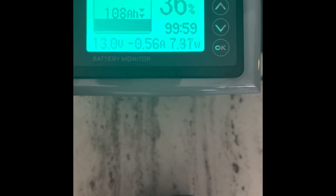This is a Renogy battery monitor, recommended by William Prowse. If you want to know anything about solar, lithium, or these types of setups, William Prowse is the guru. Right now I'm showing 13.0 volts and a 0.554 amp draw on the batteries — I have some motion detector lights probably drawing that half amp. So there's a loss of 0.11 volts here in the main salon.